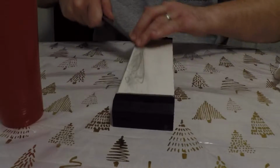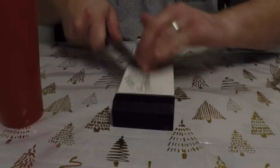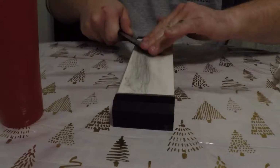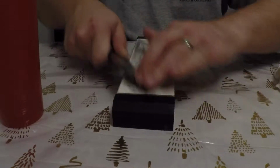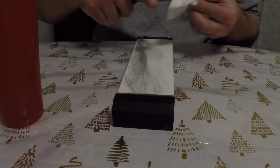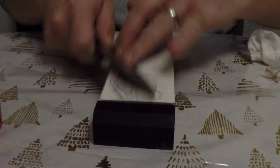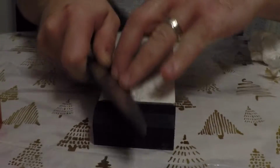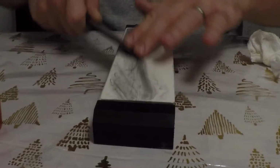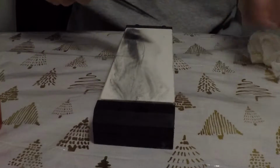Anyway, the knife that I'm using is hand forged. It's 1084, heat treated to about 59 to 60 Rockwell. The knife tested 64 HRC out of heat treat, and then the temper theoretically should have brought it down to about 59. For Christmas, basically all my family went in on knife making classes for me. So this past weekend I took a beginner intro forging class with someone who competed in Forged in Fire and took second place.